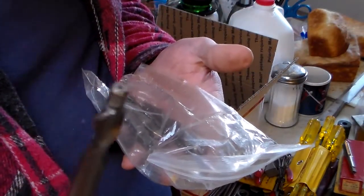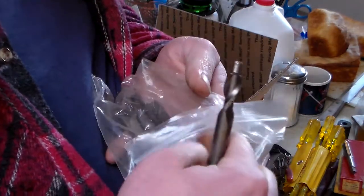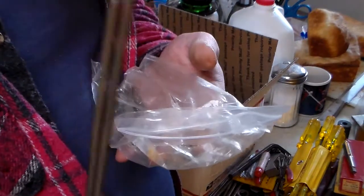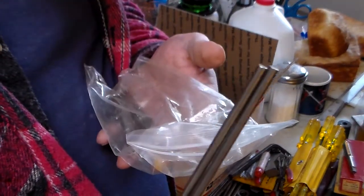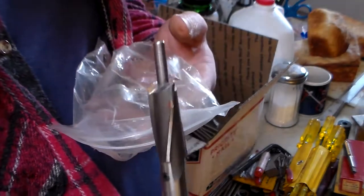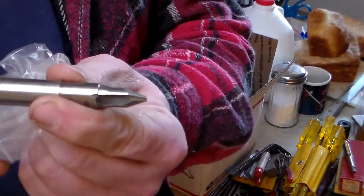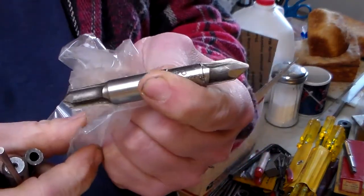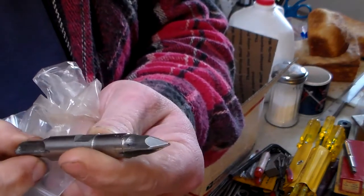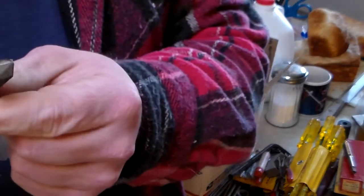Looks like a piloted mill of some sort, a reamer. Got, looks like a half-inch mill. Couple of small rods. Maybe this is what they use to turn them jack screw with. There's two of these. Looks like another piloted reamer. And a deburring tool, countersink of some sort. This is homemade. It says 60 degree on there. Started out as a 7/16 end mill, I think. It says Putnam 7/16 high speed. But that's the box.